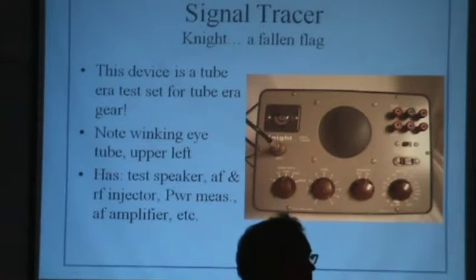Yes? I did not. I just got the issue, and I just flew back from California, and I hadn't had a chance to look. I'll look for that. Oh, very much so. John's pointing out you can get the series resistance on a cap with a little meter described in the latest issue of QST. That would be handy to look at the caps. If the resistance is very, very high to begin with, then you probably have a good chance you might could run it if it isn't shorted.